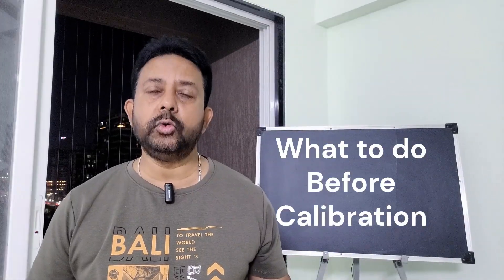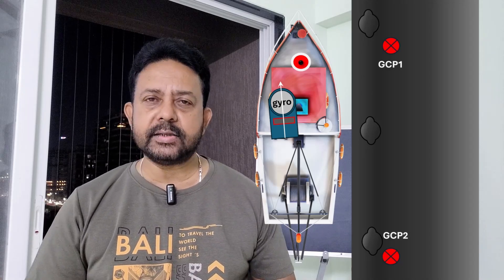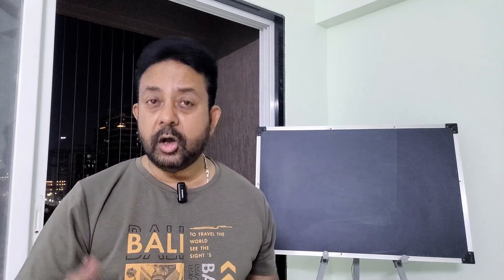Next, let us discuss what you need to do just before you do the calibration. First, have a kick-off meeting with the vessel crew and the vessel master and set up your laptop with all the incoming data from the GNSS system as well as the gyrocompass. Make sure that the data coming to your laptop is good. Next, or simultaneously, you need to establish at least two ground control points on the jetty at a convenient place. The vessel's GNSS antenna and the full length of the vessel must be visible from both stations, and there has to be a line of sight between the stations. Make sure the stations are clear from any traffic and will not be disturbed during the survey, and the ground control points must be a minimum of 30 meters apart — the farther, the better.